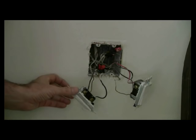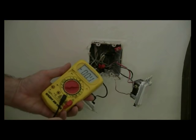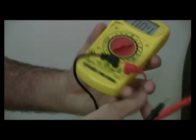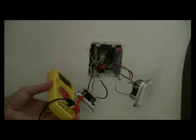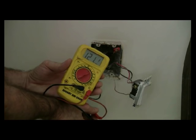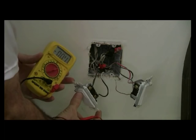The only cause that can happen here is once I've done my testing. This is my ohmmeter, and I've put it on 200. I've placed the dial to 200, and I have a common — which is my black — and then the red cord going to the V for voltage versus amps or ohms. I'm going to carefully touch here. This is live and I'm doing this for a test — I do not recommend that you do this on your own. It's showing 121. So the connections are good, but when I go outside I have a problem. Let's go outside and do the same test there.